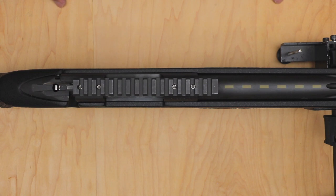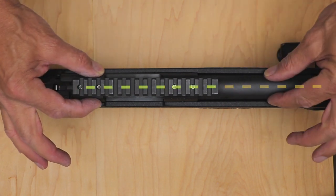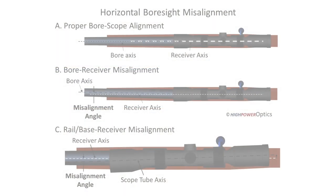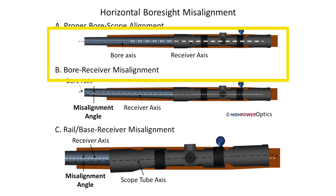The purpose of this inspection is to determine if the barrel is mounted crooked in the receiver. If this problem exists, I discuss what to do about it. Ideally, we want the axis of the rifle bore mounted coaxial to the axis of the receiver — that is, parallel to the receiver in both the horizontal and vertical directions.